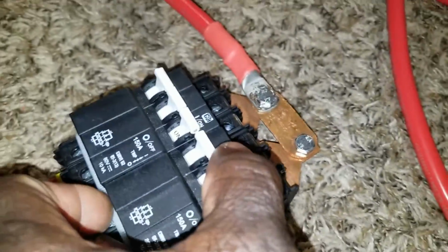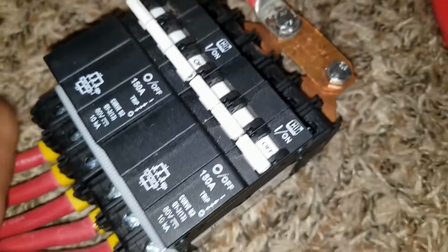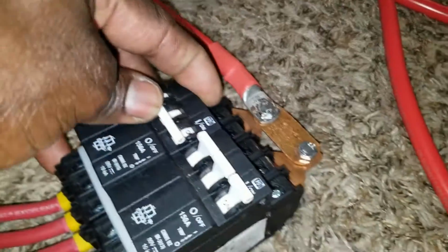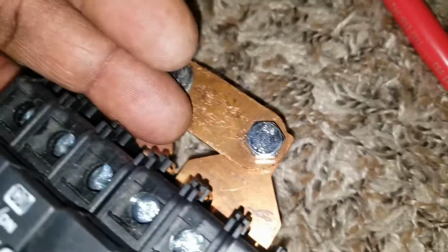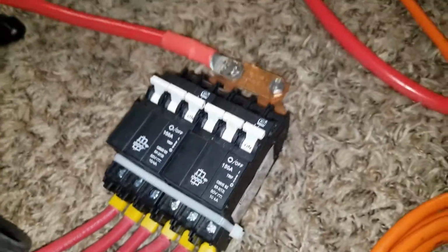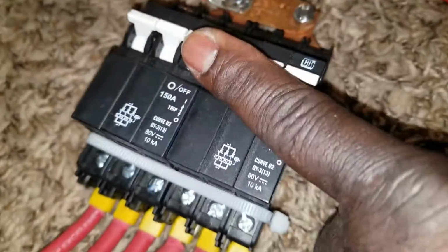But I kept them. I have to make sure the breakers, if you put it this way, if the battery is all turned off, it's not going to be able to balance the batteries, the cells, the modules. So I have to make sure I leave the breaker on, because this is how the batteries are all tied in parallel here. So all the power is almost like going out to the inverter, but it's not going there. It stays right here. That keeps the batteries in contact. Each module is now tied into here just like this. So I have to leave the breaker on all the time. If one module is about to be drained or is losing power, it is always balanced. Though it's already in parallel, they have to tie somewhere else. That's why I use this, and I have to turn this one on.